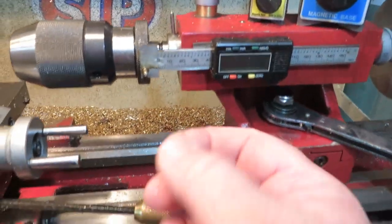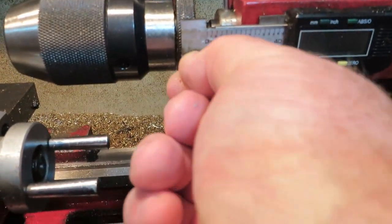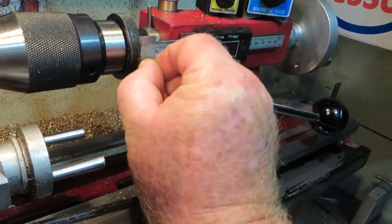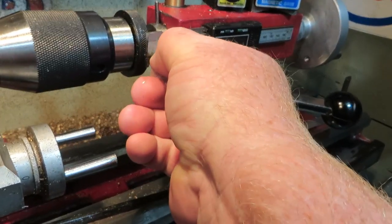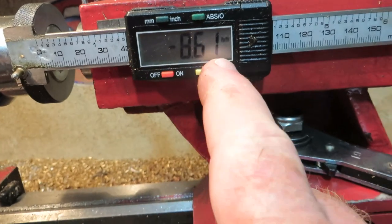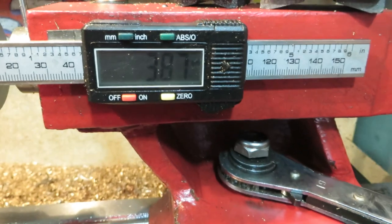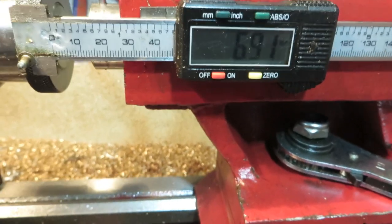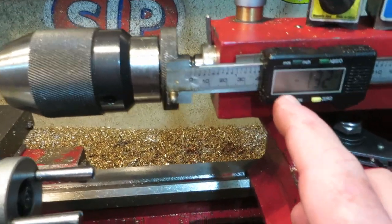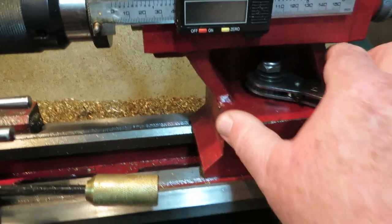This is handy. I drilled that and put a pin in here that goes like that. Turn it on — zero it. Fantastic. Having the DRO on the tailstock has been a boon. So if anyone's got any type of lathe and you haven't got a DRO on here, try and get one — it really makes a big difference.